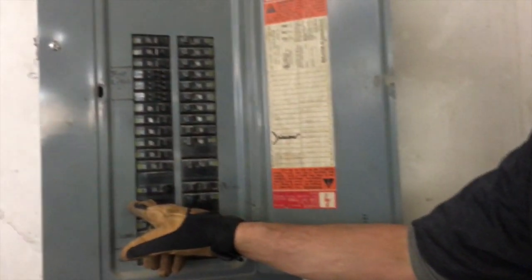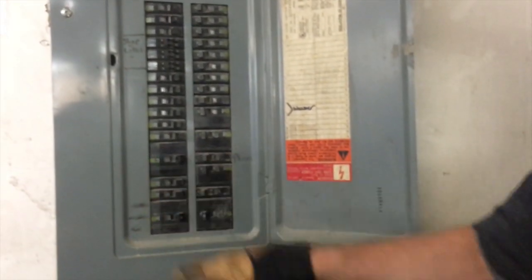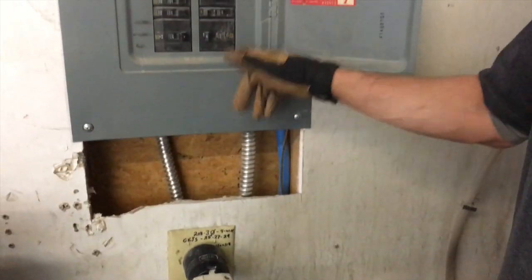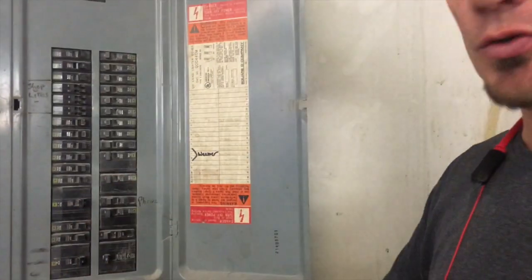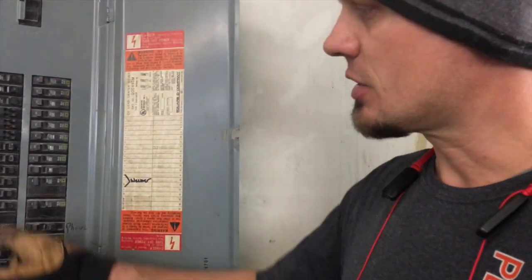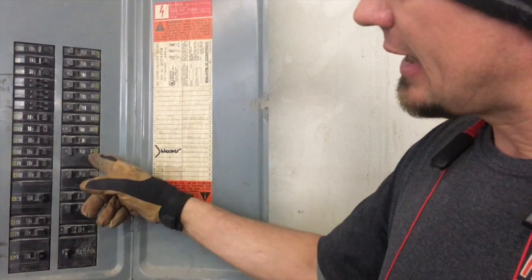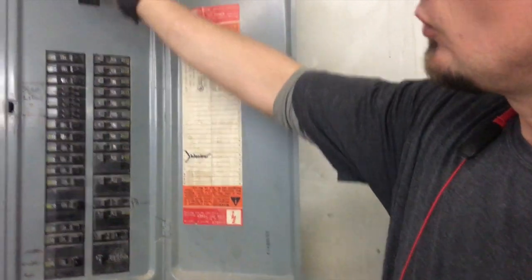Before they start pounding again — we found the wires loose inside on the breaker, especially the B phase. Down here we had blue wire caps with everything twisted together, and the red wire on the B phase was loose as well. This panel is ABC — black, red, blue — and the welder is on A and B.